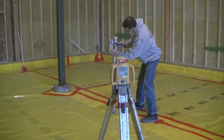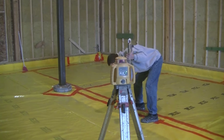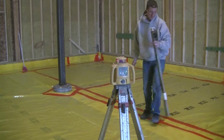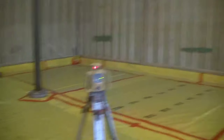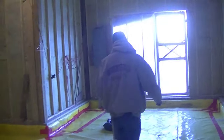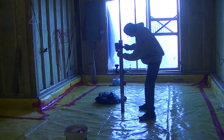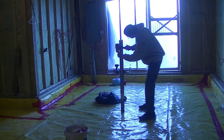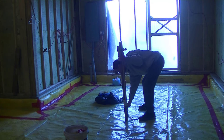When I got all done shooting my grades here, this floor figured around 16 and a half to 17 yards at four inches. But it ended up figuring about 21 and a half to 22 yards because of how thick the sub-base made things — they just didn't put enough material in there before they put the poly over it. So you're going to end up having to pay for an extra four and a half to five yards of concrete.